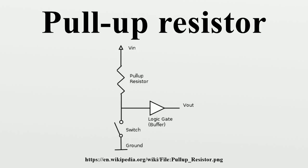Pull-up resistors may be used at logic outputs where the logic device cannot source current, such as open collector TTL logic devices. Such outputs are used for driving external devices, for a wired-OR function in combinational logic, or for a simple way of driving a logic bus with multiple devices connected to it. For example, the circuit shown on the right uses 5V logic level inputs to actuate a relay.